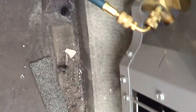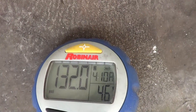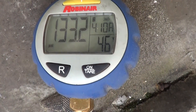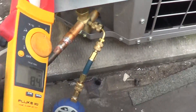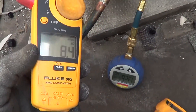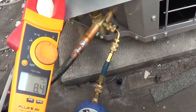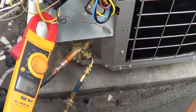We have start up here. Suction pressure is 132, and it's 46 degrees refrigerant temperature — so suction's doing good. We've got our amps running at 8.4 amps, so that looks good. I just gotta come back and do the insulation, fix the water leak, and change out the wire here. I also need to do some drywall downstairs. It's looking good.